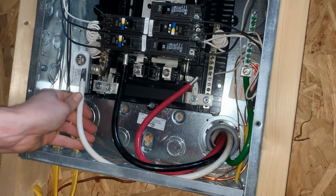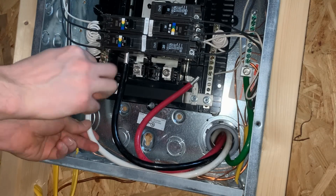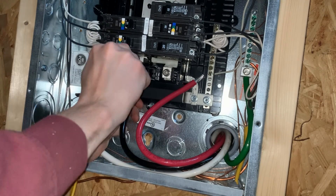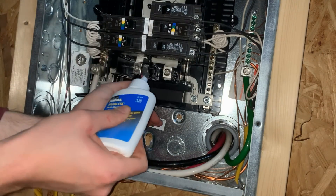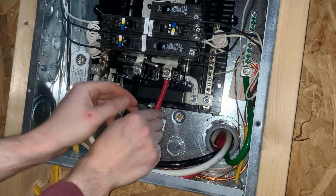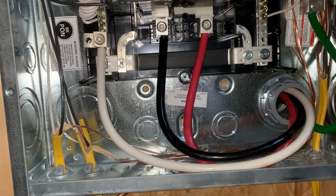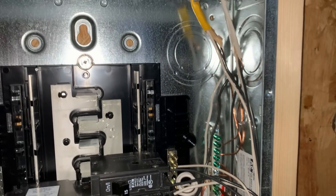With our circuit wiring finished, it's time to land the feed wires. I'm adding an anti-oxidation product to the bare aluminum before installing it. I'm starting with the neutral white conductor which mounts into our neutral bus bar. Next I'm installing the hot black and red wires which go on the central mounts — each wire will supply 120 volts and it doesn't matter which color goes on which side. And lastly we have the green ground conductor which has already been terminated to the ground bar. In a subpanel like this, it's very important that the grounding bar and the neutral bus bar be kept totally separate. Back at the main house panel these two are going to be bonded together, but again, this cannot be done at a subpanel. If these two components are not kept separate, it's possible for unintended current to flow through the ground line which could energize the subpanel enclosure.